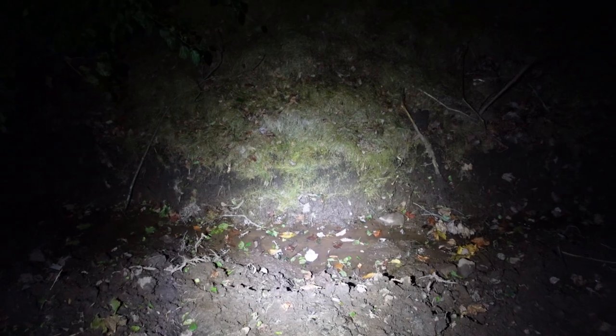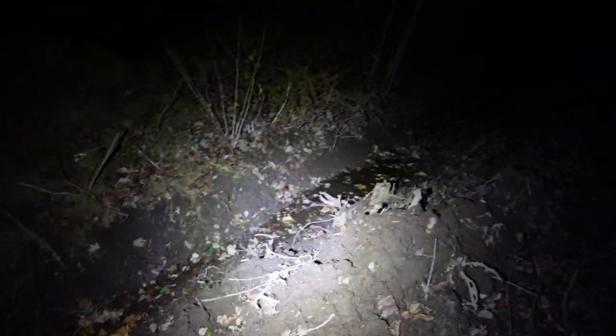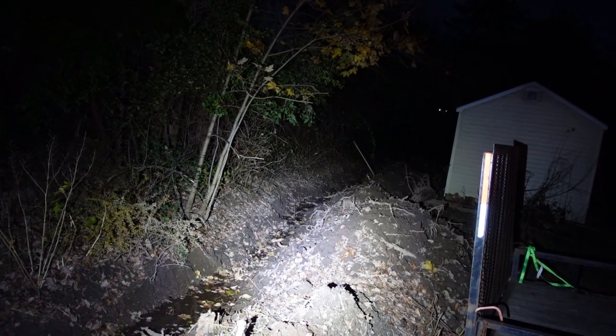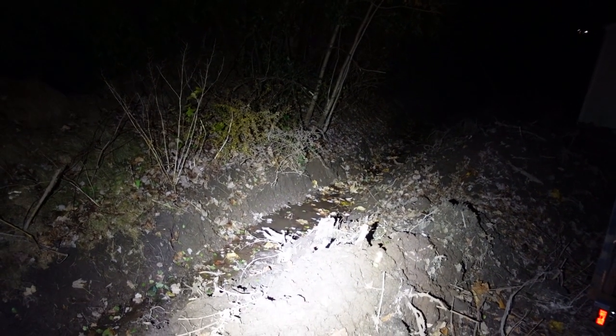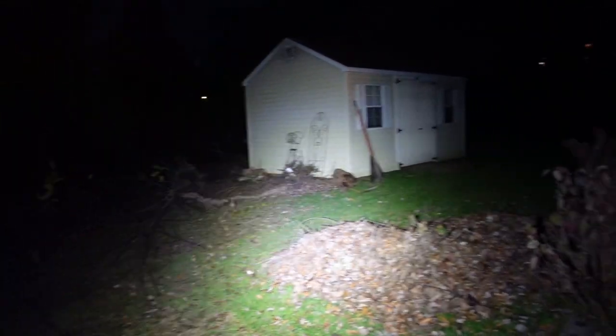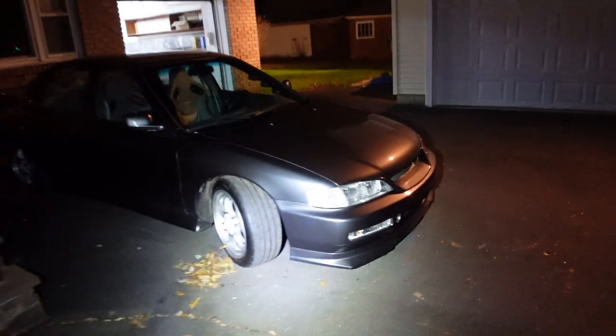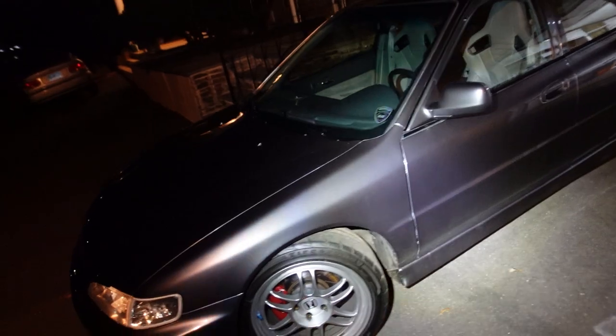What I did out here was dig this whole ditch big time. You can see a big mound of dirt on the left and we re-sloped the whole ditch to keep the water flowing through this area. During heavy rainfall and even on regular days, we have water here — the water table is really high and all the water comes off the hillside. Talking to people, it's common, and by resolving it on my yard I should help the neighbors on the hillside too. We've been using a tractor with a backhoe attachment that I've been allowed to borrow — couldn't have hand-dug this.